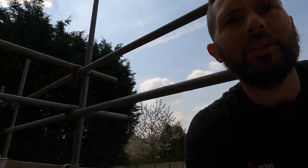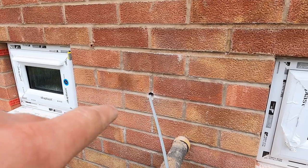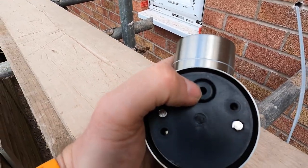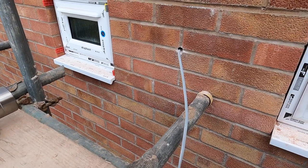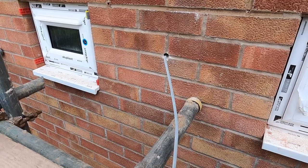It is easier when I've got a single cable coming through, but when you've got two cables — a bit of a disclaimer — there's just no way of getting two cables through that grommet. What you can do is either use silicone to seal it all up, or you can get what's almost like a plasticine-style putty. Those are the two other options to seal it up when you've got two cables coming through.